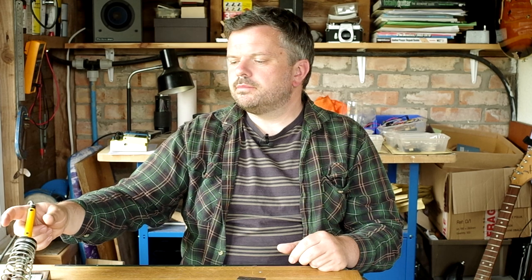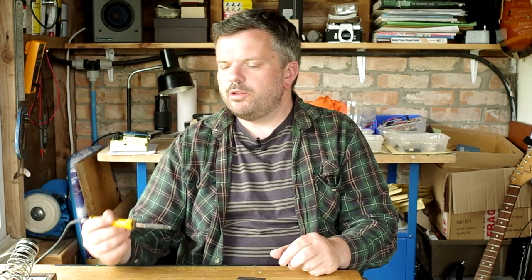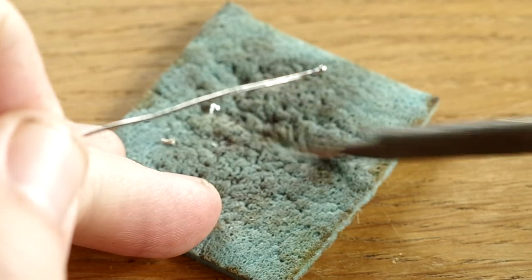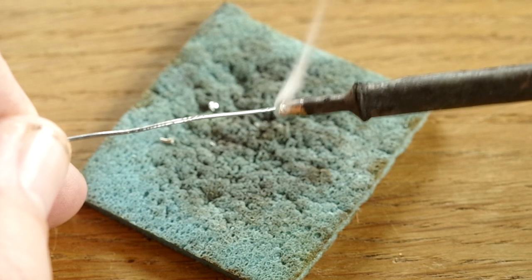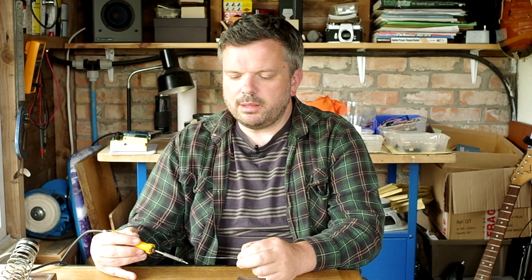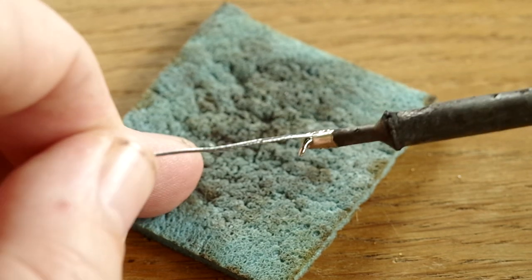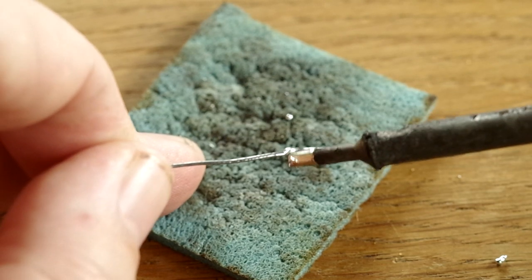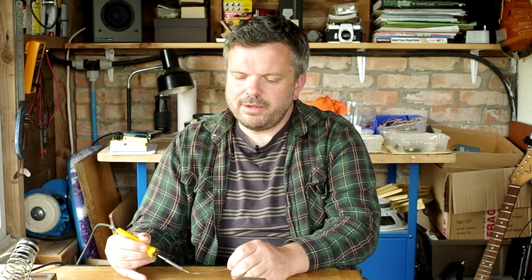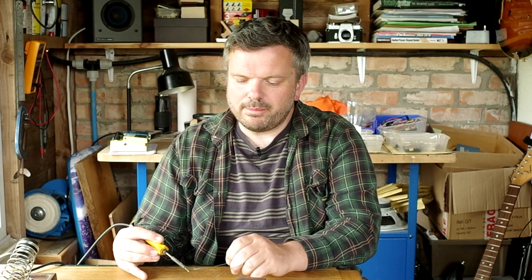Okay, so what I want you to do now is we're going to fire up the soldering iron. I've just got my sponge in front of me, nice and damp. To finish off today's lesson, I just want you to practice getting the feel for how the solder behaves. To get confident with solder we can't be scared of it, because it does flow and it can overflow. If we get a feel for how to control that, we can learn to master it. So what we're going to do is clean our tip in the sponge, then add some solder, keep going, and just experiment — maybe put too much on even to the point where it overflows and drips onto the sponge. This will give you a feel for how it behaves and help you build the confidence of manipulating the solder.